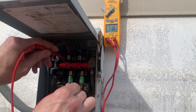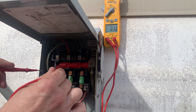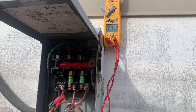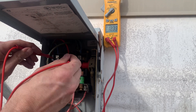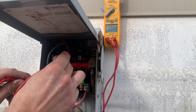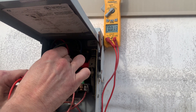I can prove that — line two to two is zero, two to one: zero. I always try to describe it like algebra: you have 120A, 120B, and 120C, and what this is doing is measuring the distance between the two. If I've got 120A on one side and 120B on the other, that distance is 213. But if I've got 120B and 120B, that distance is zero. Which is how I know this is line two — because when I hit line two, it's zero.